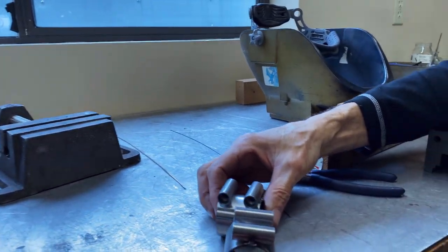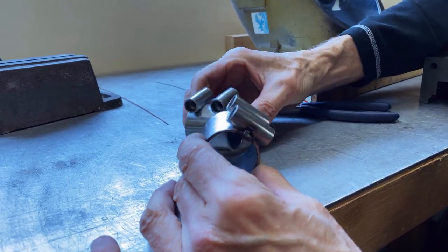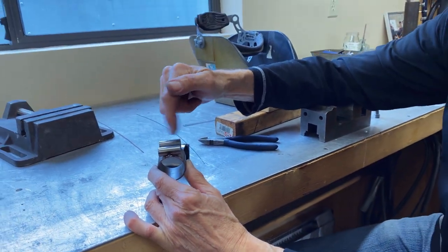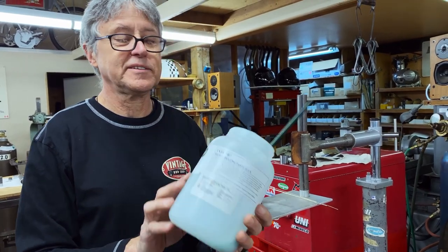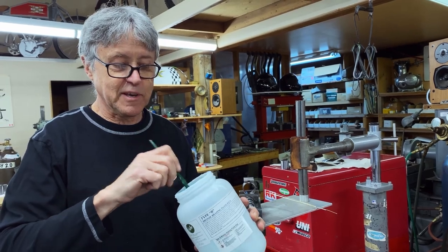They have to be brazed now - I'll use nickel silver because that's the rod I'm going to use, and it's TIG tacked on the outside. I'm going to heat up the inside first because there's no sense starting on the outside if the inside isn't held. We're going to put some Type B paste flux from the gas flux company on here.